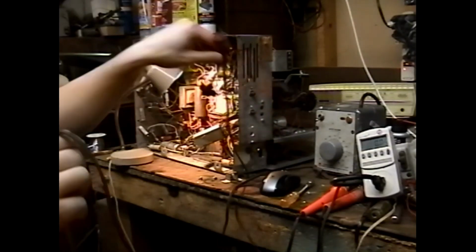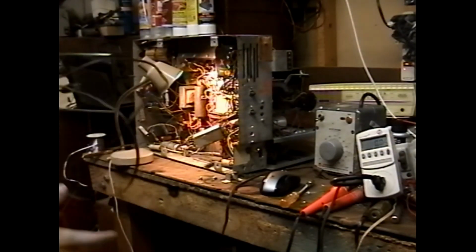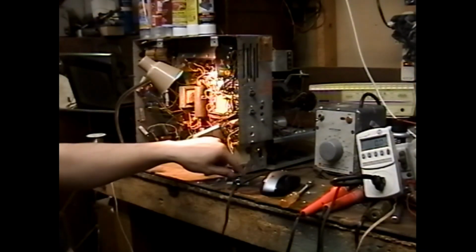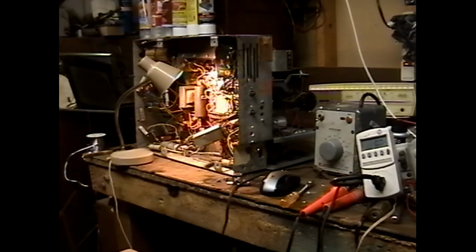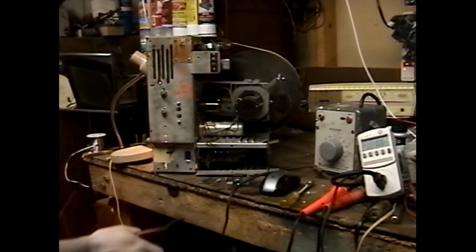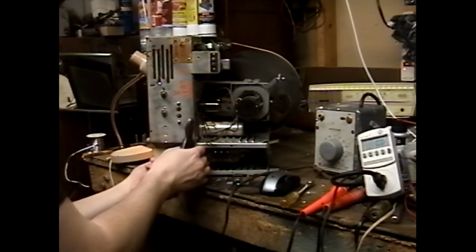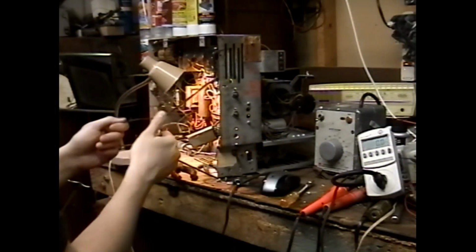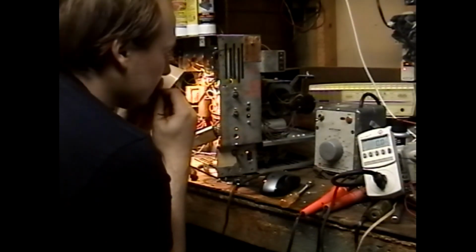Since we've all but confirmed the power transformer is shorted, we're going to do one last thing to make sure it's shorted before we declare this thing a lost cause. I definitely don't have any power transformer with an integral rectifier socket on it, so any replacement power transformer I try to install in this set is at best going to be a terrible jerry rig. I have very little regard for the power transformer's safety and health at this point, so that's the AC input winding to it. Let's just fish that out. And now that it's fished out, let's just strip the ends and